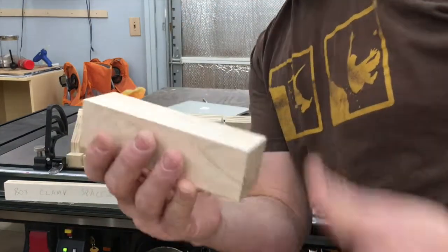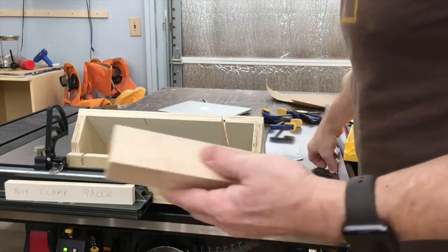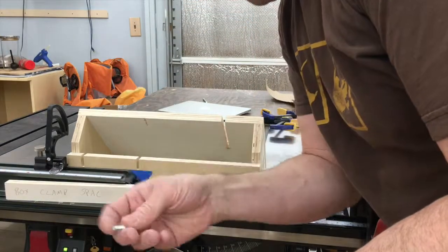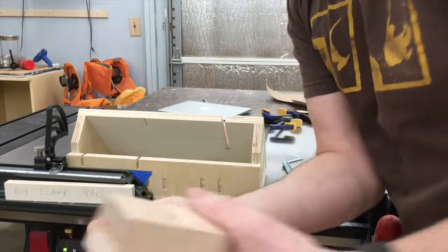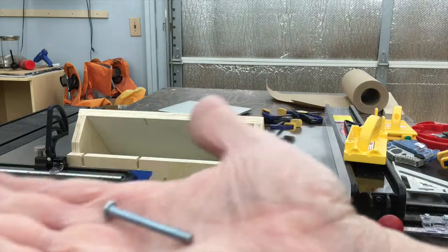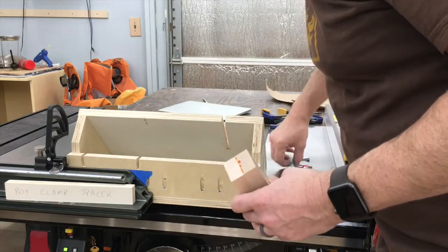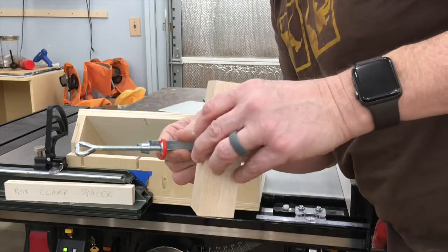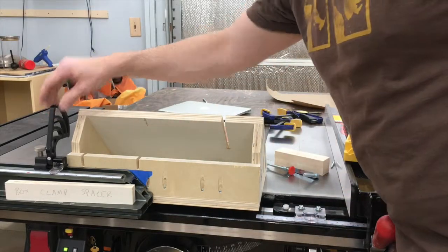What I'm going to do is just take this block — it's just a leftover piece from a helmet stand I made — and drill a hole in the face of the block. Then just using a tap, I'll go ahead and tap the hole. Then I can use this screw as a micro-adjustment. I'll drill a hole 90 degrees off of that so I can clamp this using a rod clamp, directly to the stop block.